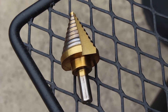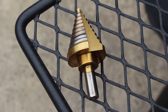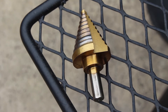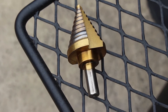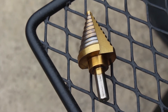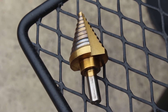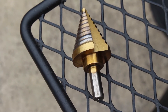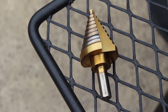If you have a floor drill press, my suggestion is to do this before you assemble the cooker. Just take the cooking chamber on its end, put it on the drill press, and bore through that way — you will see that it's much easier. I've used drill presses many times; I just don't have that size of a drill press. So the step drill bit up to an inch and a quarter — take your time, lubricate, and you'll actually get through it better than I did if you run it at a slower speed.